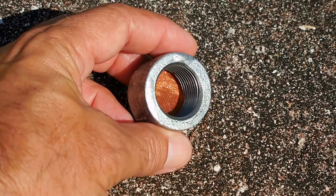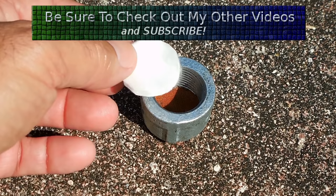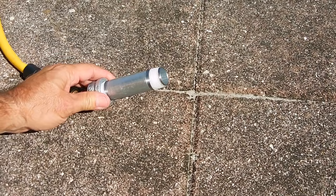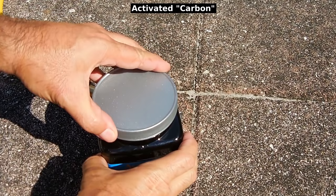Each one of the caps is going to be done the exact same way. Now that the mesh has been installed, I'm going to be taking a small piece of fire-retardant cloth and placing it on top of the mesh — that's going to prevent any fine granules of activated charcoal from finding its way through the mesh. Each end is going to have this applied. Once it's pressed all the way down it's going to look like what you see right here. Teflon tape was applied to the three-quarter-inch by four-inch galvanized nipple and it was threaded into the cap which is connected to the hose. Now we're going to take the activated charcoal and pour it inside that pipe.